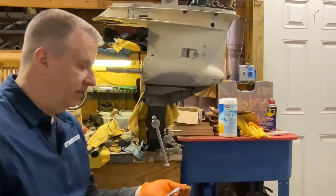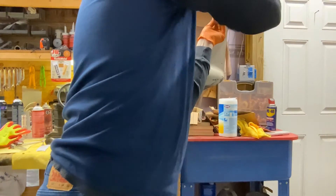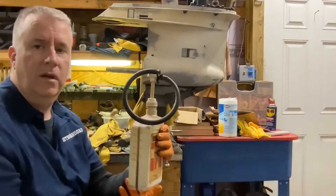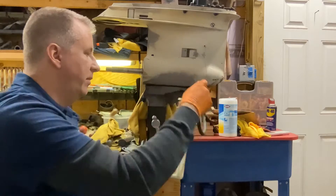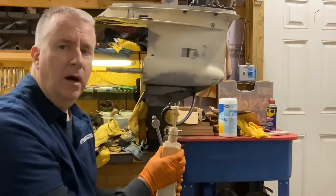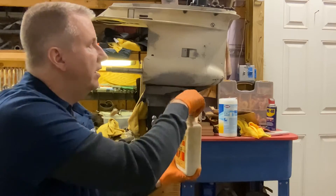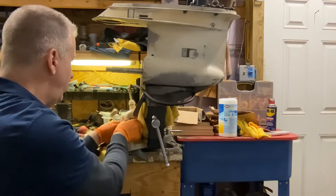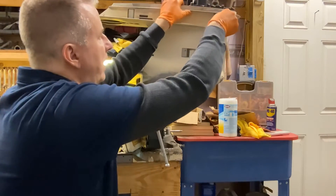Looks like we got most of the oil out. I'm going to go ahead and put the top plug back in. Then I'm going to connect my hose with my oil. This is just an old oil bottle — it has Johnson-Evinrude lower unit oil in it. I always like to use the manufacturer's oil. On the lower unit it's not as critical as it is with two-stroke oil. I'm just going to pump it by hand and it's going to pump the oil in, and eventually it's going to come out the top. I just put the plug in to slow it down, then we remove it so we can watch the oil come out once it's full.